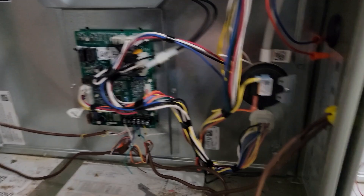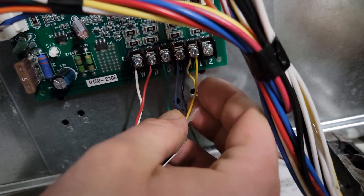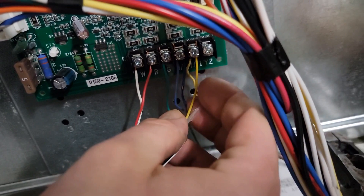That is how you twin these two furnaces — you use a simple relay with a normally open set of contacts. C and W energizes the coil, R and W energizes the next furnace. On this setup, we also connect a wire from furnace board number one — we connect the commons C to C, we connect Y, and we connect G — so that we energize our fans at the same time.